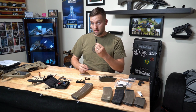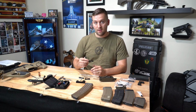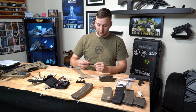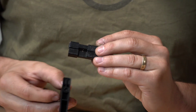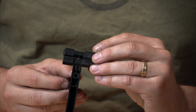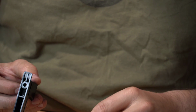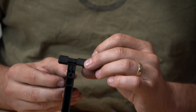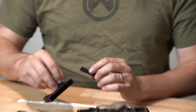The second safety that we have is an over travel stop safety for semi-auto only. The way that works, if you can see the stock safety right here, you can see the pass-through channel. When it's on safe, it's oriented like so. When it's taken off safe, it allows the trigger to pass fully for semi-auto and full auto. Ours, on safe, acts the same way, but off safe, it only travels far enough for it to release the hammer for semi-auto fire.